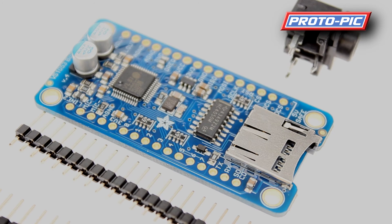Next up we have the VS1053 codec board with onboard micro SD slot. This is PPADA1381, version 4 of the board. On there there are inbuilt line-out capacitors — these are decoupling capacitors, so it means you can run it through an amplifier. Whereas on the previous boards they didn't have these decoupling capacitors, so the board would not be compatible with going to an amplifier.